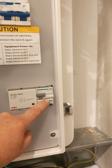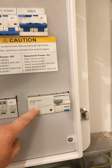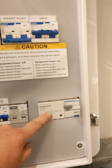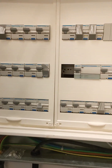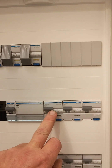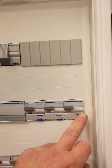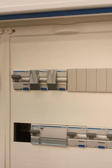This is for a single point of isolation - it's a four-pole contactor which disconnects the SIG Energy inverter and disconnects the backup smart port generator as well. We also have our smart loads RCBO, which over on our consumer unit as you can see is not labeled yet. Up here we have a B63 four-pole contactor - 63 amp - and we have our high loads. For instance, this might be the oven, this might be the hob, this might be the jacuzzi, this might be the EV charger.